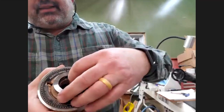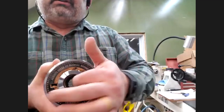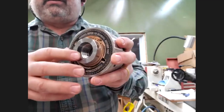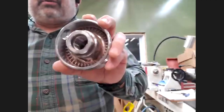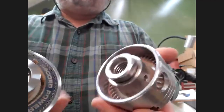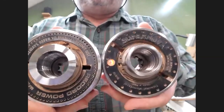This Record Power chuck has an insert — right now it's a one-and-a-quarter-inch insert. If I need to move it to a different lathe I just buy this insert for about $25-30. Nova has their own inserts too. The Record Power insert is noticeably beefier compared to the Nova insert — you can see the difference. The nice thing is Record Power and Nova jaws are compatible with each other — you just have to swap jaws two and four because Record numbers counterclockwise and Nova goes clockwise.